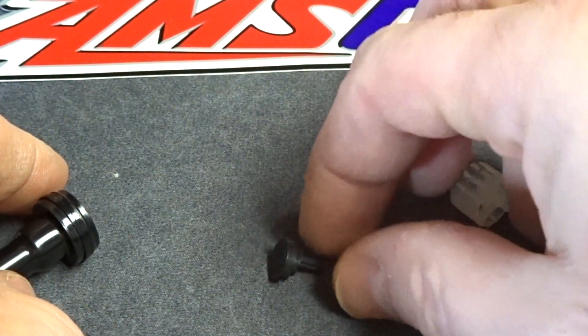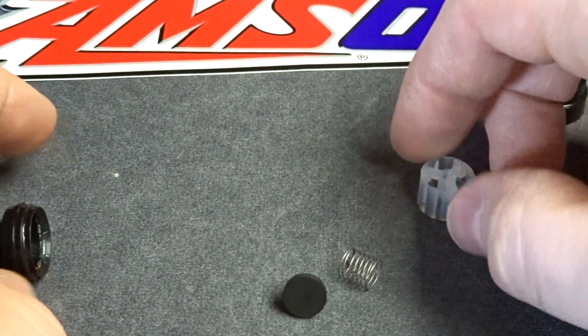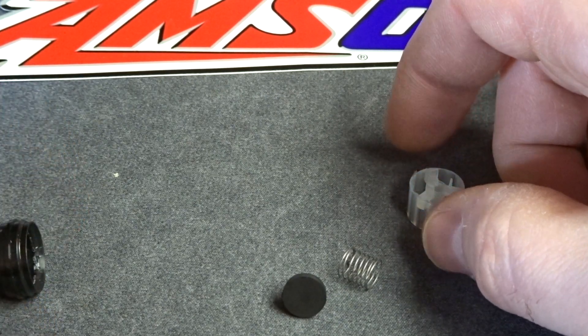It's spring loaded — it's got this little spring here and the spring is actually pretty easy to compress. That gives us a crack pressure of about 0.3 PSI, maybe a little bit less than that, but it's pretty close to about 0.3 PSI.